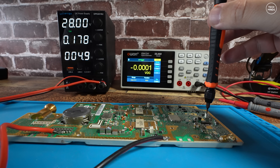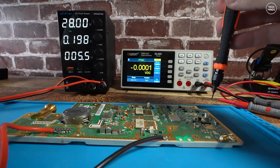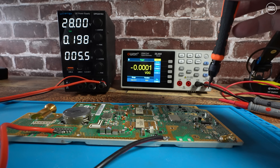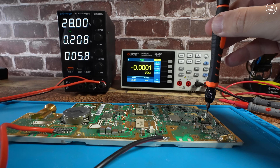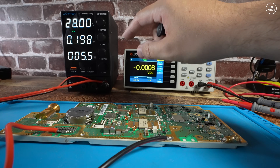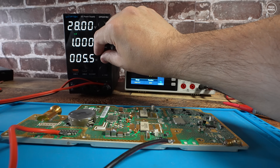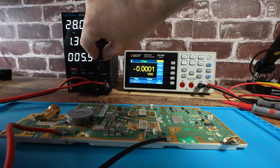The last part of this video covers applying power and setting the bias current. The pallet works with 28 volts and will need a power supply capable of at least 33 amps at 28 volts. Before applying power I turned all three white pots fully clockwise to set them to the lowest setting, then powered up the supply at 28 volts DC. The first pot — the single one in the middle at the start of the amp — needs to be set to draw 200 milliamps. I was told the current can suddenly rise, and ideally I should use an analog ammeter, but instead I used the current limit feature on my bench supply, then turned the pot extremely slowly until it hit 200 milliamps.